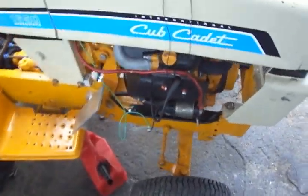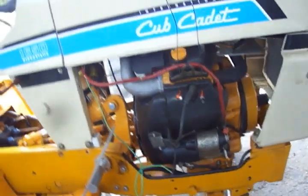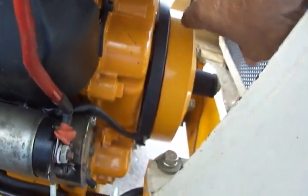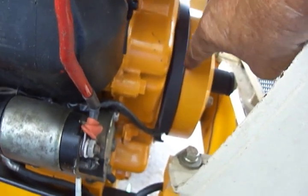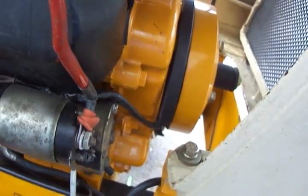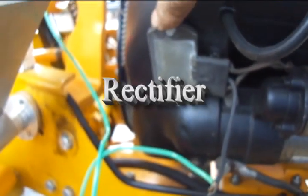And this generator motor, it didn't have a charging system because the generator itself was the charging system. What I did, this is my charging system now right here. This is actually a flywheel off of my 16 horse. And this piece right here is part of my cover of my engine. My stator's inside of there. This part is all part of the Kohler engine. This and this. And I cut that flywheel down in the lathe and put this all together and got my stator in there. I cut a hole inside my engine right here and put the stator in there. It didn't go in there.